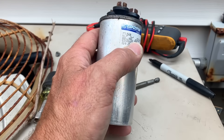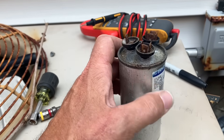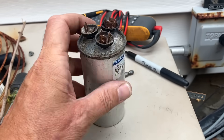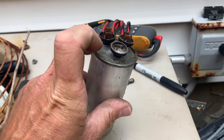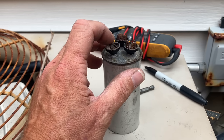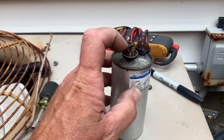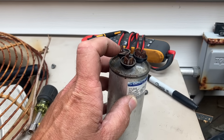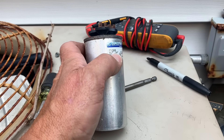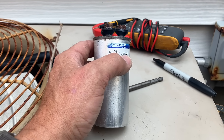This capacitor has a bunch of numbers but we only care about three sets since it's a dual capacitor. Dual capacitor means it has a HERM terminal — normally three posts — a COMMON or C terminal with four posts, and a FAN terminal — normally two posts but here it has one. Fan wire goes to FAN, COMMON connects from power and to the hard start, and HERM goes to the hermetically sealed compressor. The ratings are 45 µF, 5 µF, and 370 VAC — making this a 45-over-5 370 dual capacitor, and it happens to be round.